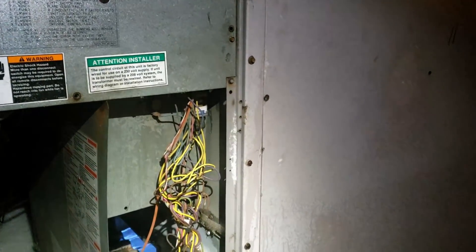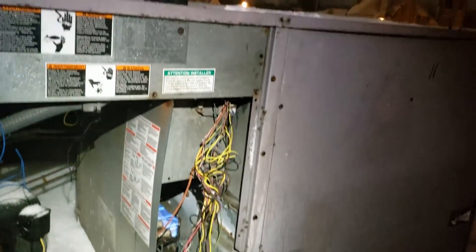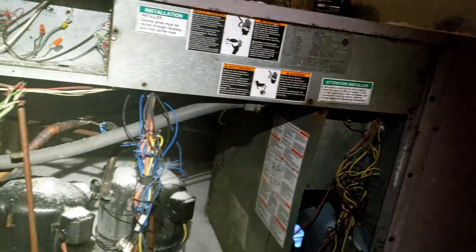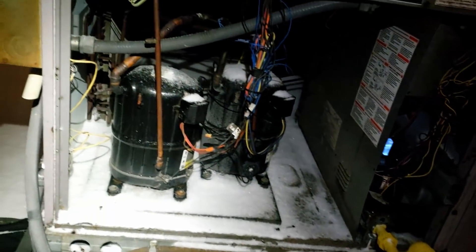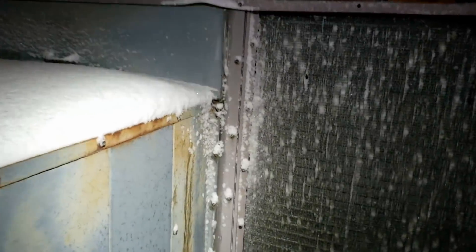I'm going to let it run for a while before I jet out of here. Like I told them — at the rate we're going, a blower motor and a control board. I don't have that on the truck, especially that blower motor — it's a pretty good sized one. You'd have to drive all over trying to get it with the supply house open and everything. If there's another place that can take people, you've got RTUs there, there, there, and one back over there. You may just have to re-room people somewhere else. As long as we can keep that blower running — I think that was the biggest thing, the blower not running like it was. I'll come back and check filters and stuff. Not going to waste a lot of time with it tonight.